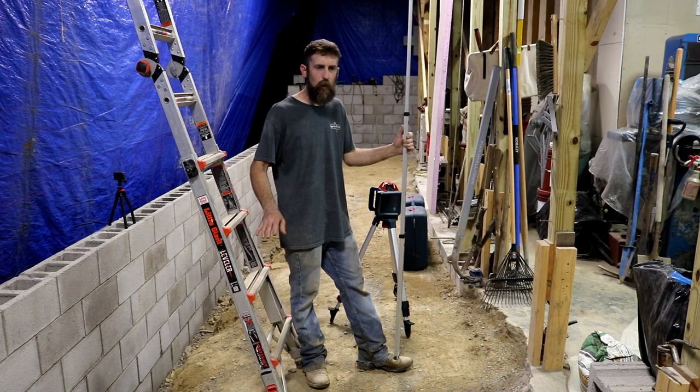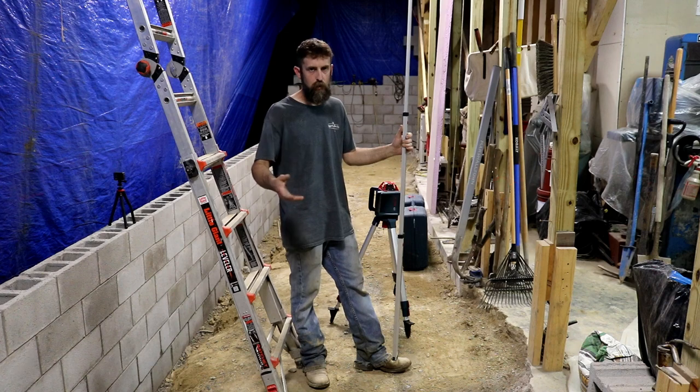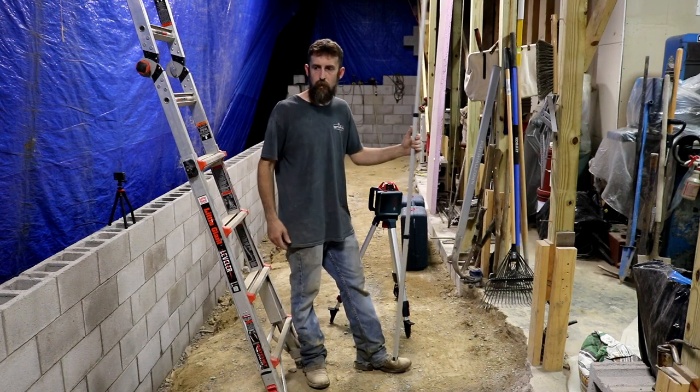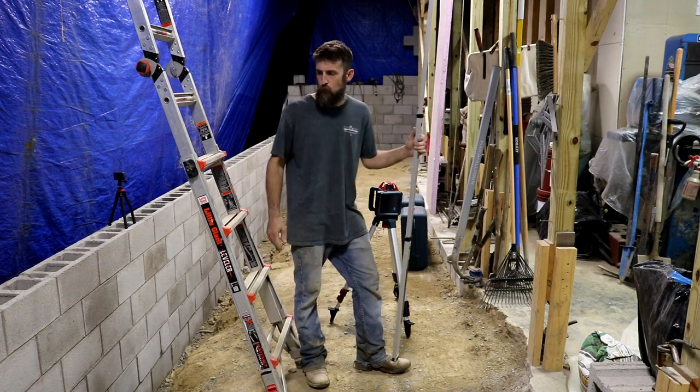And I would go 8, but that would put me slightly over a full truck. A truck holds 10 yards. And I don't want to play the numbers that close when it comes to concrete. You want to always have enough. So 7 inches is good. That's what I'm going to roll with.